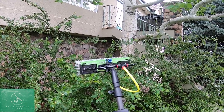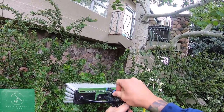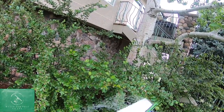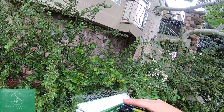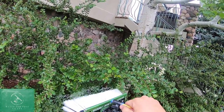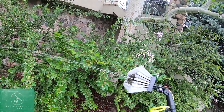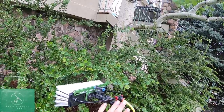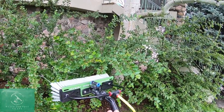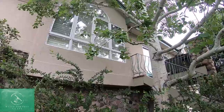I have the Tucker over-the-top rinse bar here, but I'm not using it today. I'm not using a pump — I have okay pressure, but at 40 feet the pressure will get less and the water will just go right into the bristles and won't go over. So I'm going to stay using pencil jets, which will require a little more rinsing, but overall it'll be okay. I have the swivel on here — easy for angles. I do not have a bronze wool pad on because this house is cleaned every six months and I just find I don't need it, so it's an extra step you can take out.